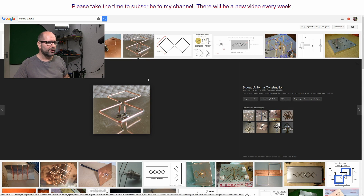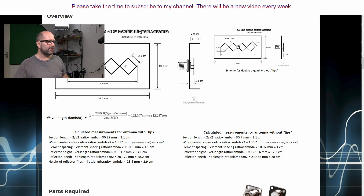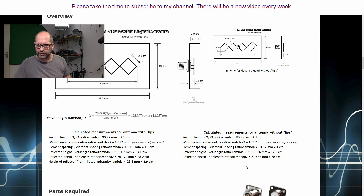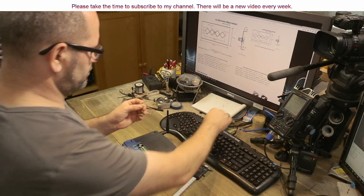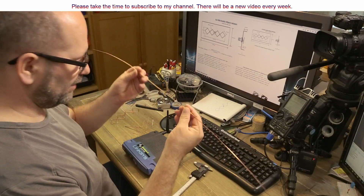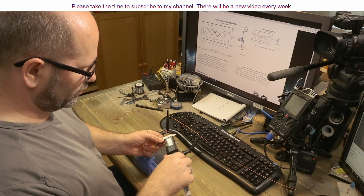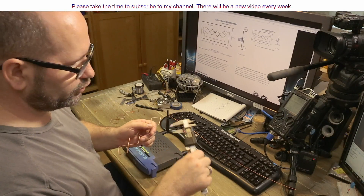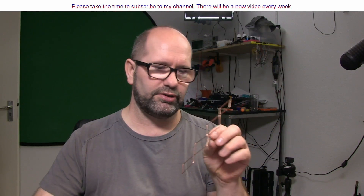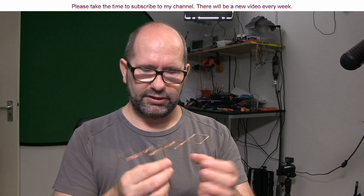You can use copper wire to make your double bi-quad or single bi-quad antenna — there are many examples, and this is a very nice one. I looked into how to make one and what the dimensions should be. I came across the website buildyourownantenna.blogspot.nl, which gave all the dimensions you need to make such an antenna yourself. I went to my workplace and took some copper wire — basically the wire you normally have in your walls going to the outlets. I measured it by hand with my calipers: it has to be 3.1 centimeters or 31 millimeters. I tried to make it that way.